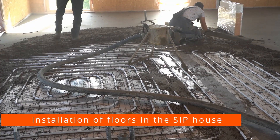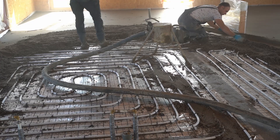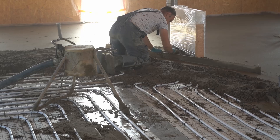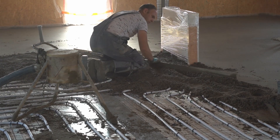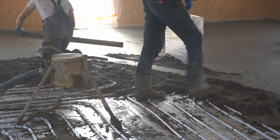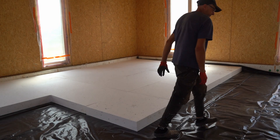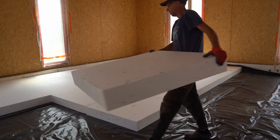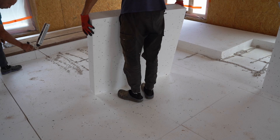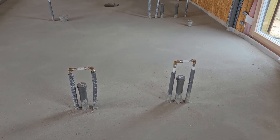The simplest way to install floors is to pour concrete. The concrete is poured and leveled, after which tiles, laminate, or vinyl flooring can be installed. Heating pipes are often installed within the concrete layer. Before pouring, an insulation layer is laid — at least 30 cm of polystyrene foam for cold climate zones. Geo-textile is placed at the bottom, and communications are usually run beneath the floor.